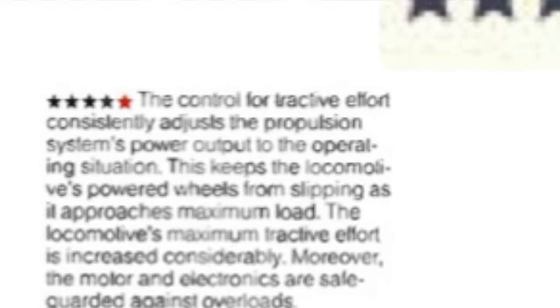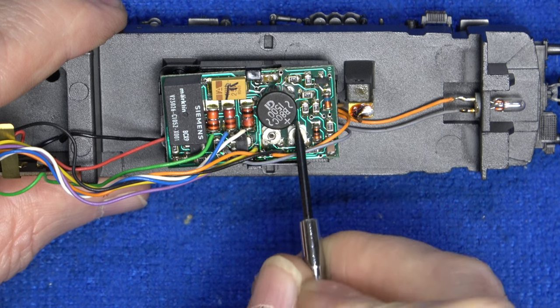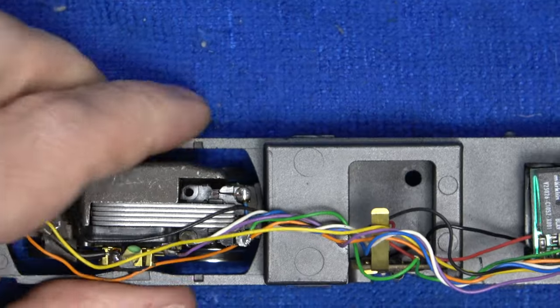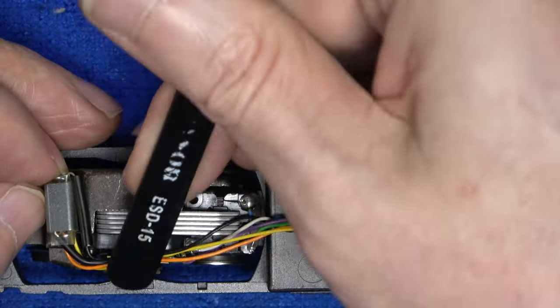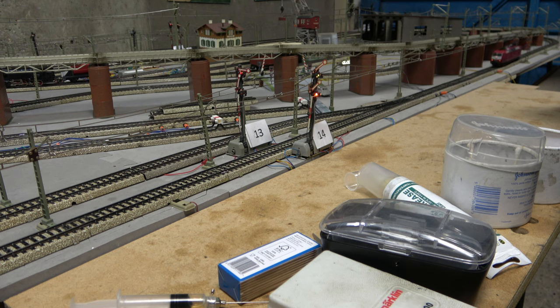I have changed the settings — they were both set to fast maximum speed and fast acceleration, so no delay. The potentiometer dial has a flat side which helps identify the setting roughly; the wiper is located on the opposite side. I have changed the acceleration setting to just under 50% and the max speed to around 60% of the available regulation. I'll do a final bit of cable management, putting the wires back where I found them, and put the body back on. Quick test — transformer at 130, 140 — the loco gradually accelerates. Cool. All that thing needs now is a run-in.